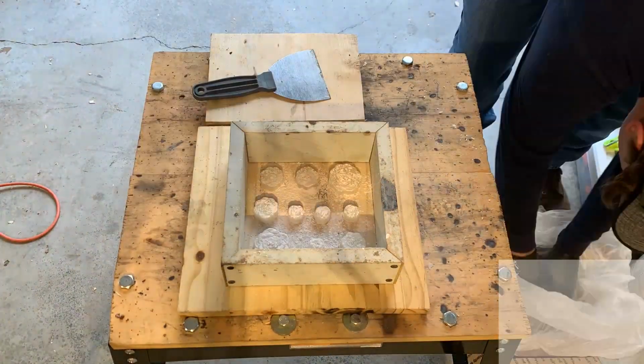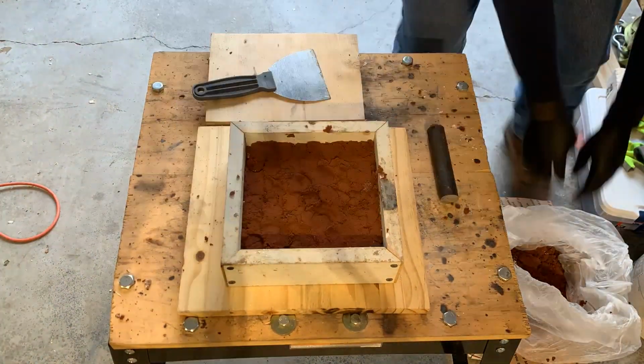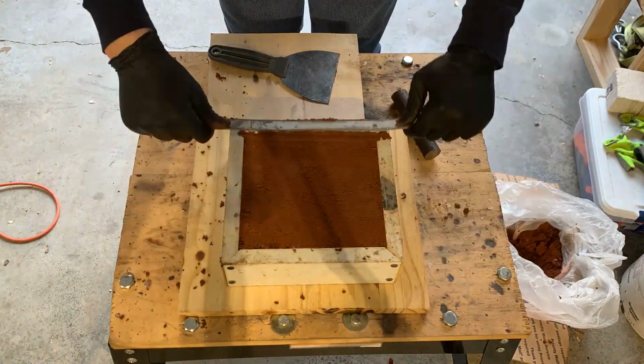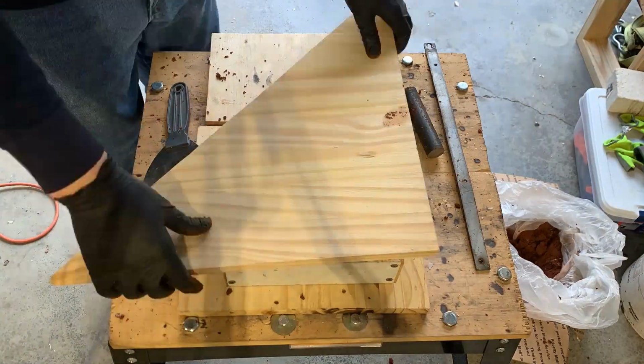So you might be wondering what petrabond sand is, and what the difference is from normal sand. Petrabond sand is basically just fine casting sand bonded with oil instead of bentonite clay.